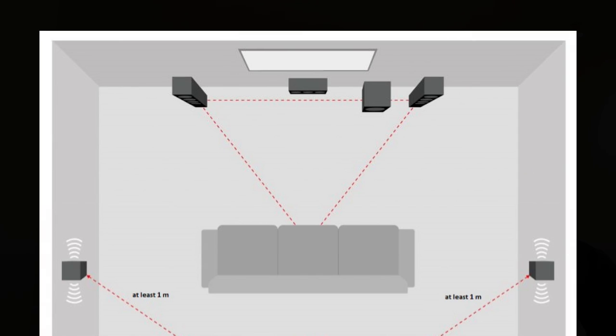A dipole speaker addresses the exit door effect because it doesn't point directly at you. Rather than firing at your ear, it fires forward and backward — so the audio going around the room is never directed straight at you. What you actually hear is a reflection from the walls around you. On each side there is one set of drivers, and importantly, the two sets of drivers are out of phase with each other.